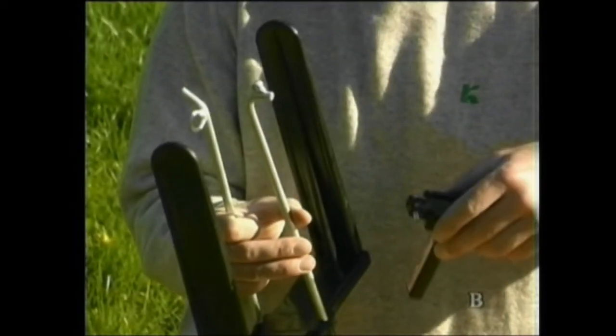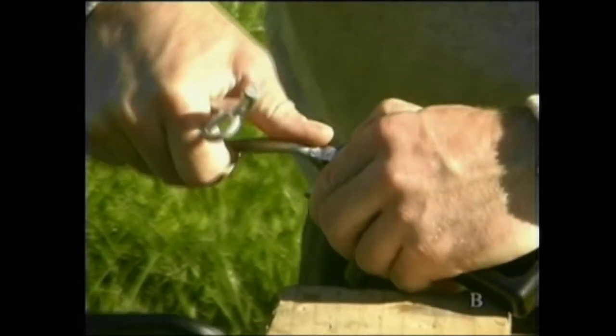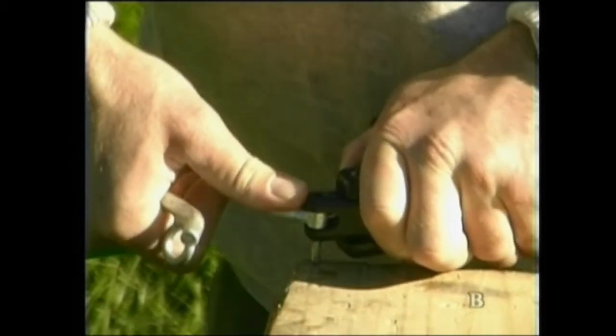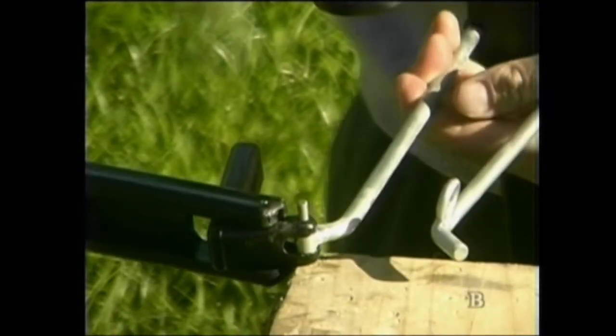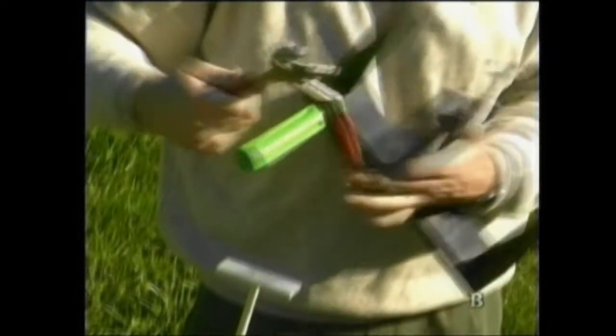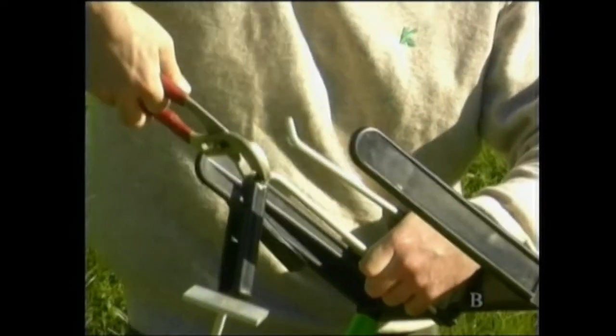Take the rack clamp, and what we need to do is sight carefully through the hole and align the pin with the holes in the rack. Initially we can get it started by pressing it, turn it over and tap the pin through. Alternatively, we could have used a pair of vice grips to squeeze the pin into position.